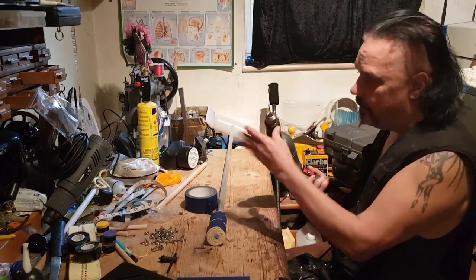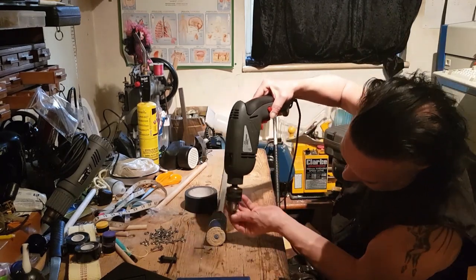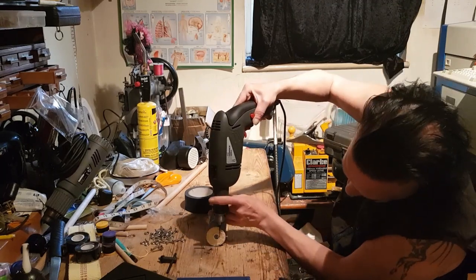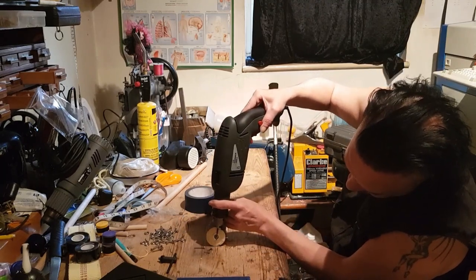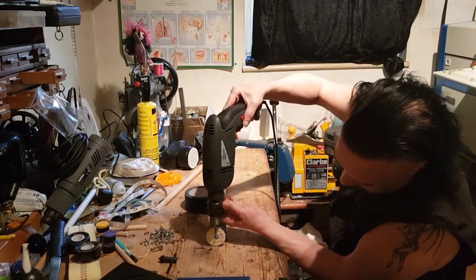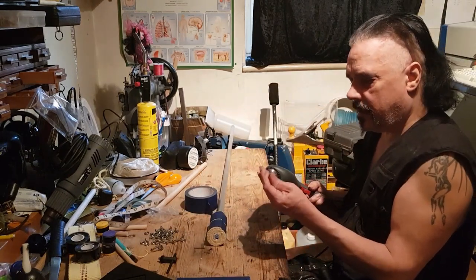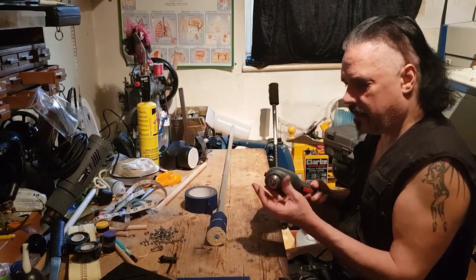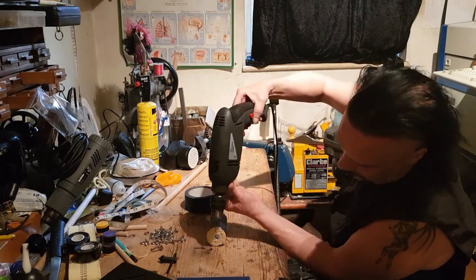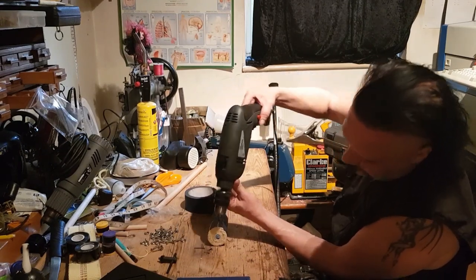But the first thing I'm going to do, before I've tightened up the drill, is measure how long the drill should be coming out. So you can see that's too long because it's going into the other side of the aluminium, and that's going well into the wood. So just a little bit further in. Check that I'm not on hammer. Christ, that would be embarrassing. That's going to be fine.